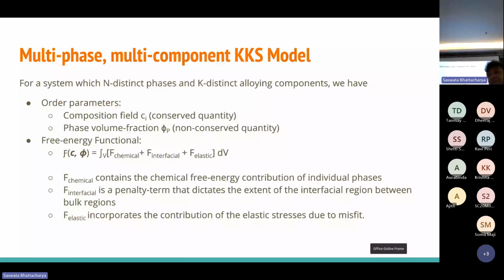That is how the structure will evolve. Structure will evolve in such a way that the total energy is minimized. Not one of the energies, remember. It is highly possible that interfacial energy, say, increases. But at the same time, you will see a decrease in the overall energy, and that happens because bulk free energy as well as elastic energy is reducing instead of increasing. Remember, total energy minimization is what gives you the microstructure. Each energy individually is not decreasing; the total energy is what matters.